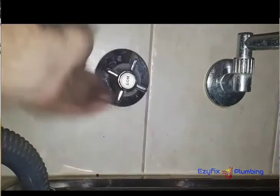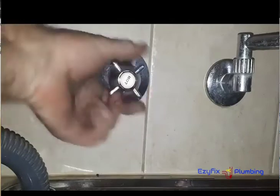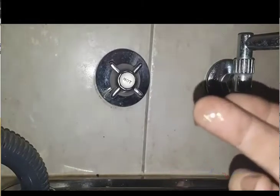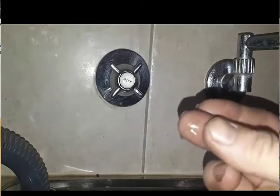So I'm going to go and turn the water on — I'll be back in a minute. Alright, water's on. All I'll do is just open up the tap valve flat out, then shut it off. Do it a couple of times just to get those brass filings out from behind the seat. Once you've done that — you can see those brass filings right there on the end of my finger. Even one piece like that getting stuck behind the tap washer and it'll just keep leaking. You won't be able to stop it.